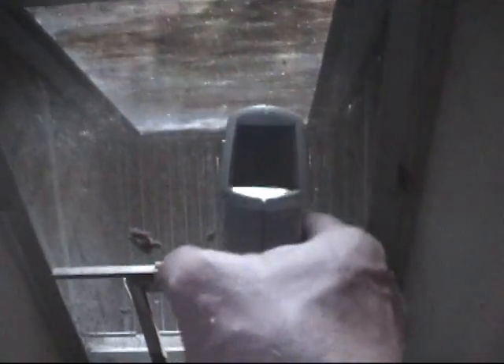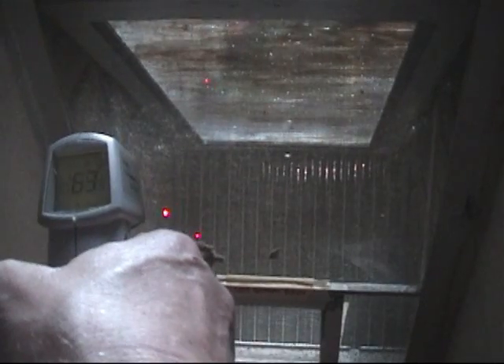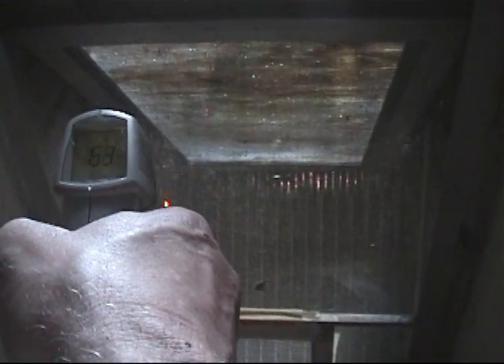So we can get some temperature information and flow rate. This is the largest coil — it's a 16-inch. I actually had to make it a little narrower by about an eighth of an inch to squeeze it between the bricks, so it's a tight fit. It's 70 on that side. This one sometimes runs a little warmer in the middle, but right now it's 63 on the left side, 65, 66, 67. There's some variation up and down too — 69 at the top. Right now this one's not varying up and down, but it depends on the wind, the airflow, and a lot of things.